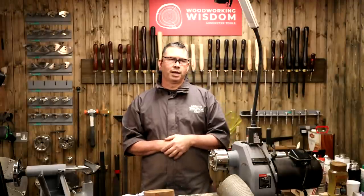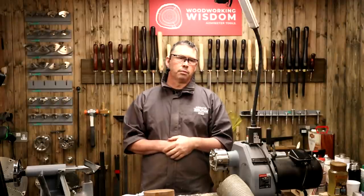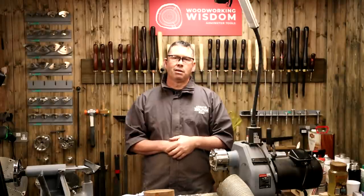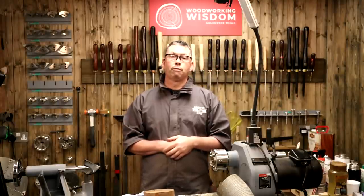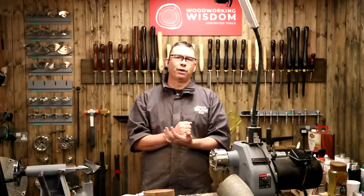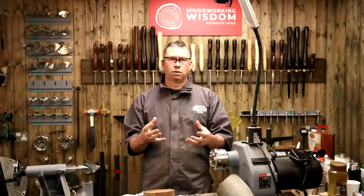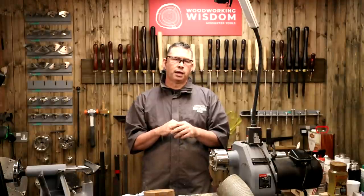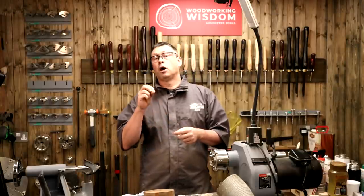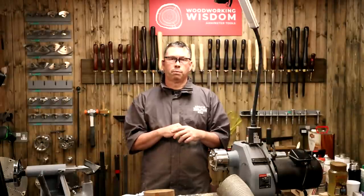There is. Again, most purists won't like it because you're faced with going down the lacquer or epoxy route. But even then, lacquers and epoxies react badly to very hot things. So if you're putting a freshly made cup of tea or coffee on any surface, it will raise the surface. If you want something you can put hot things on, you're going to have to speak to manufacturers. I would still say epoxy, but it's the type of epoxy you use.